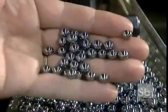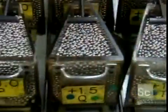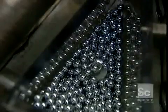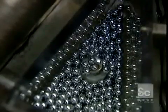This entire process takes a few days. The balls go through a furnace to harden, then they get a bath in cleaning solvent. After several quality checks, the finished balls go into hoppers, which load onto the automatic assembly machine.